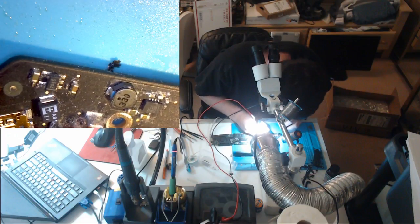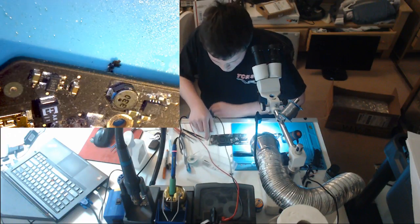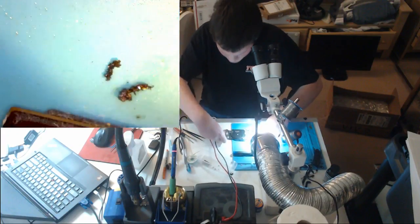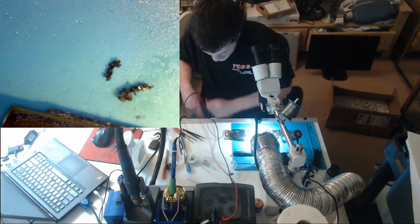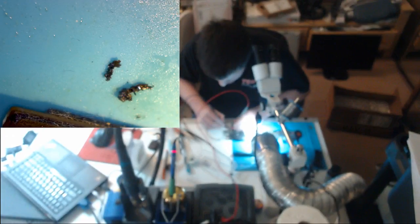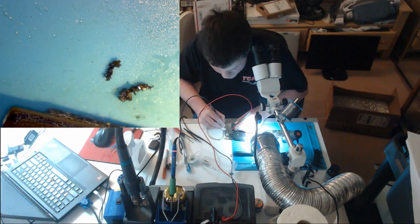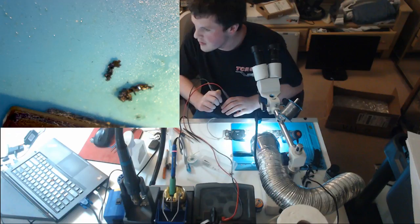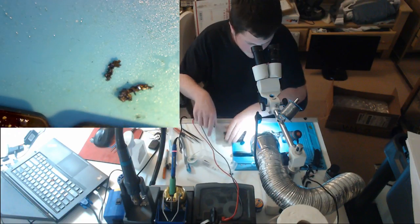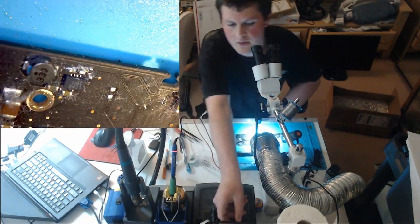Now, what is going on here? Do we have AC in voltage? Is the charger not being told to turn on? What is going on here? So, flip it over. Let's check voltage on the DC in fuse, on the DC in board, and we have 0 volts. Now, why is this? Why do we have 0 volts? Is there a short? So, we can only assume that our PP3V42 area has a couple capacitors that look real nasty. Let's check for a short on PP3V42.